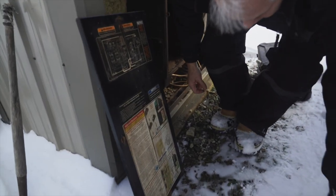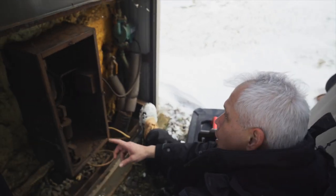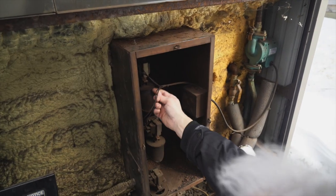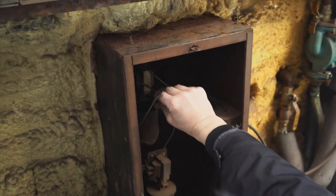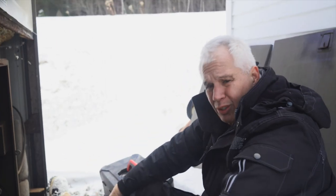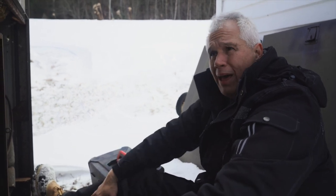The parts that are important to understand in this box: you'll see there are two solenoids that lift these closures off these pipes, and both of these feed manifolds in the firebox. What's important is to make sure all of these solenoids work as well as the blower, and that enough air is being generated to push through those manifolds inside.